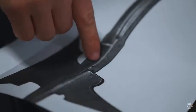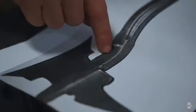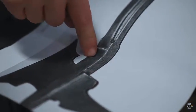Oh boy, no. Looking closer at the photo, I just worked out how these things were made. This is not going to be easy. This strapping that connects it to the handle is individually welded onto here. This strapping is stuck on to the material of the pole arm with a forge weld, and then the strapping comes out. That's tremendously difficult.